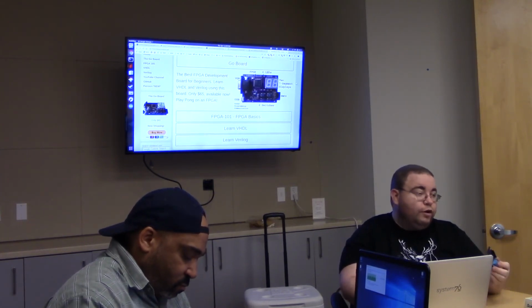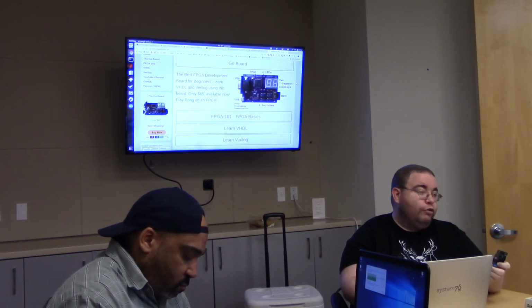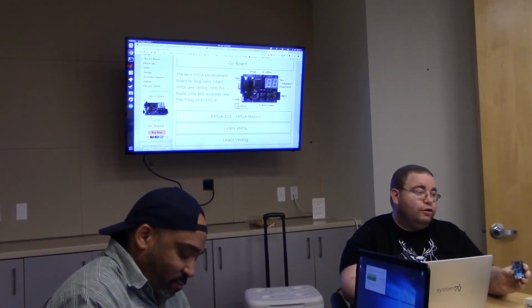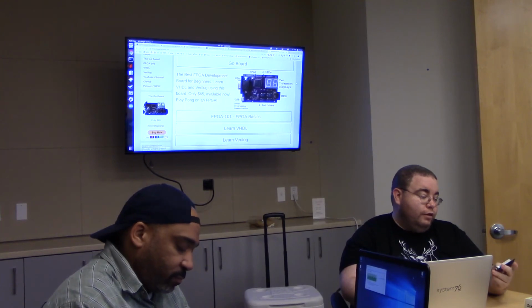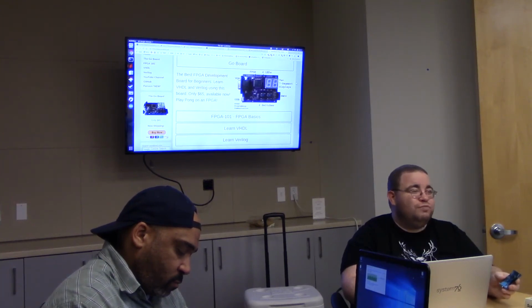As far as putting them on a board, putting a microcontroller on a PCB design is super easy. Putting an FPGA is a little bit harder. This thing needs 2 separate power supplies, a big diode for some reason. It doesn't need a clock source, but if you want to do anything clocked, you need a clock source. And then you've got the whole circuit with the flash ROM too. So it's a little more complicated than that, but not too much more complicated.